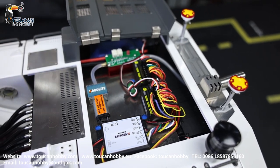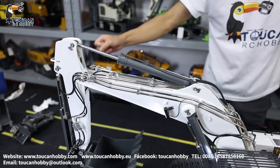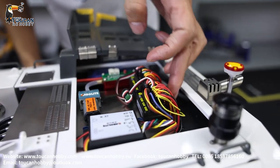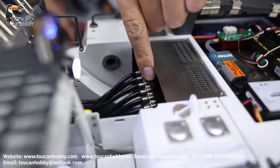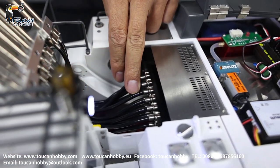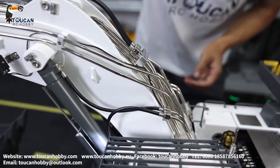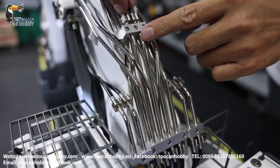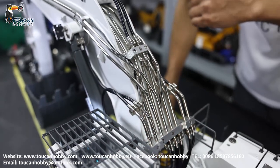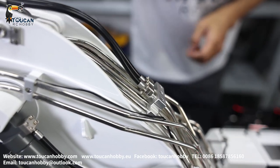Because we got six channels of hydraulic control — big arm, small arm, bucket, and the quick release — and two more channels for spare upgrades; that's six channels. So down there will be the directional valve — you can see it's under there — leading the hose to here. This valve is leading all the hose to each channel. And here you got this shining metal pipe. What is beautiful is this junction, these connections — it is all made with screws so you can connect and disconnect easily, very safe, no leaking. Also the hose is secured by this metal pipe, no screws, so not damaging the hose.